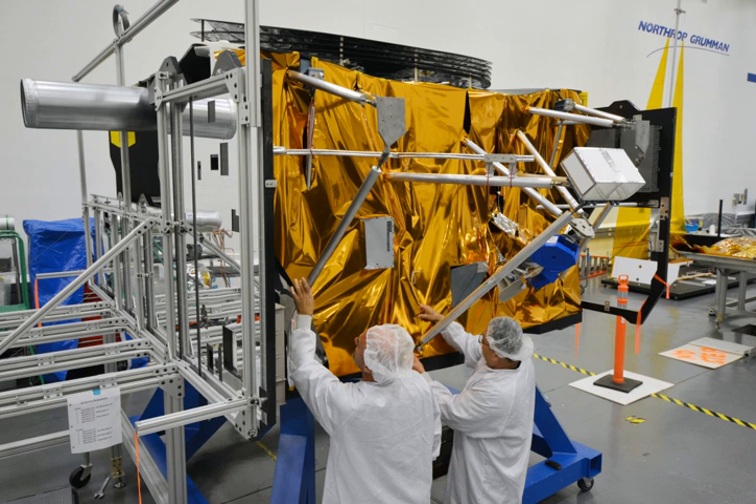The rechargeable batteries of JWST are the lithium-ion type. The batteries use the Sony 18650 hard carbon cell technology. The batteries are designed to endure spaceflight and should sustain 18,000 charge-discharge cycles. The solar panel is in what's called a tail-dragger configuration and includes five segments. Each solar panel structure support is honeycomb carbon fiber composite.